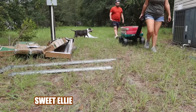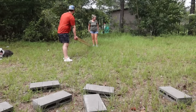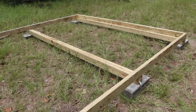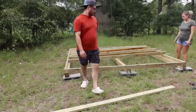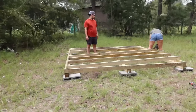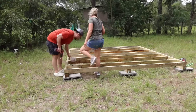I went back and forth on whether I wanted the shed in the front yard or the backyard, and I decided to put it off to the side of the house where it's hidden out of sight and close to the back door. I also like a wood floor because it'll be easy to move the shed if I ever decide to. They give you the dimensions for what size the floor needs to be, which was really helpful. Because it's a wooden floor, I got pressure treated for extreme weather. I do wish I had painted the plywood to seal it before putting the shed on top — so go ahead and seal the plywood so you don't have to worry about water damage.